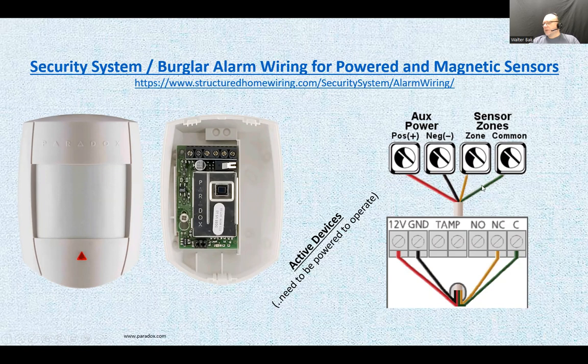So this would be just a dry contact. The purpose of that is to give you a dry contact, open and close. That's all the system is looking for from the motion sensor. If it's just an old analog one; you can have them digital, so that's a different story. And all the rest of the circuitry has to do with how it recognizes motion. Mostly it would be an infrared or microwave sensor, or sometimes they use laser beams. You never know.